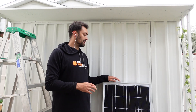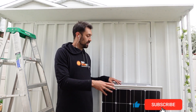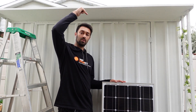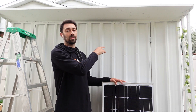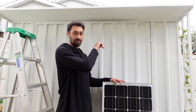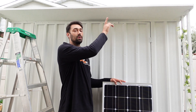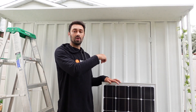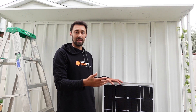What we're going to do now is take the two 100-watt monocrystalline solar panels, put them onto the roof, and take the MC4 cabling that's already going out the back into the charge controller. We're going to wire that into the panels, put these panels in series, and then see if we're charging up our battery bank.